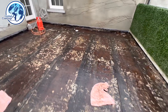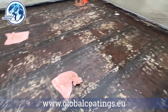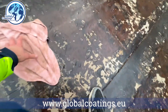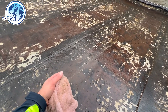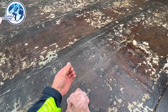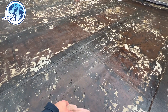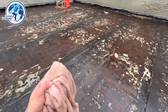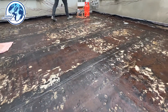Now that we have the balcony power washed and clean, we have to dry it before applying the Lava 20. The way to dry it is to use towels — we buy new towels every time — and dry every single drop of water off the balcony before introducing heat. The problem with using direct heat from a torch on felt is that it releases the oils from within the felt and brings them to the surface, which can affect adhesion at a later stage. So we take every single drop off using rags, then use heat from about a meter away to avoid direct flame.